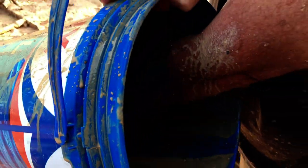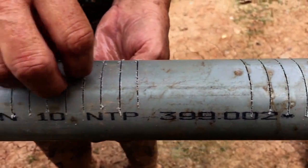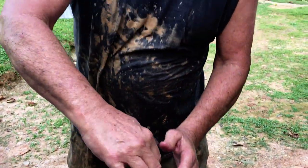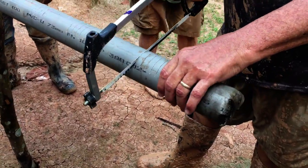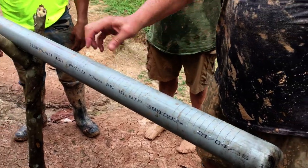Still got a little bit of rock but we're getting into some sand too — you can see little chips of rock there. This is the casing, the bottom section, and it's the screen — it's where the water permeates into the casing and then rises to whatever level. This piece right here was cut with a hacksaw; you can see the little points, then we heated it and bent it over. He'll go along here with the hacksaw and cut one saw-blade depth, then turn the saw blade over and get another saw-blade depth, skip a little space for strength, and continue.